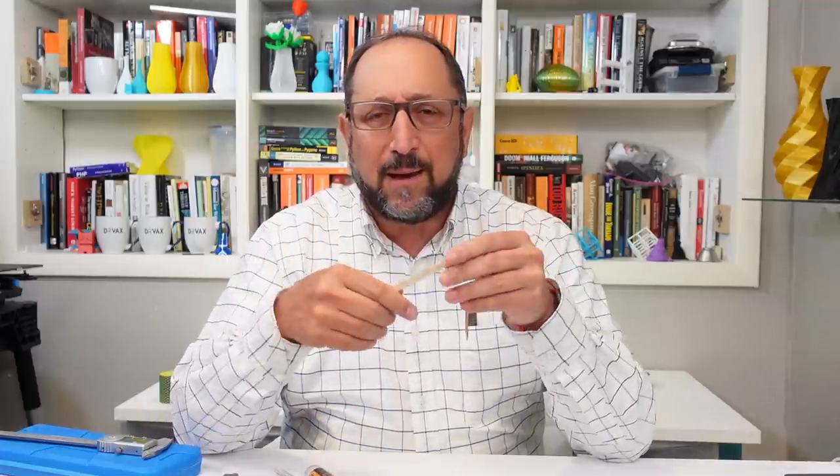Item number four is the least expensive item I'm going to talk about: you need a Popsicle stick. You can order 1,000 of them online for just a few bucks. Very often when you're starting a print, you print a purge line to start the filament flowing, and then your print head moves to where it's going to start your print and may pause for a second — the idea is to knock off any filament hanging from the nozzle. A Popsicle stick is perfect for that. It's softwood, it won't damage the nozzle, and you won't hurt your fingers. You really never want to use needle nose pliers to pull filament off a nozzle because you might damage it. Also, if you have a touchscreen on your 3D printer, this works great for touching that screen.